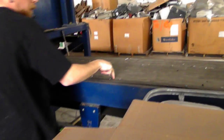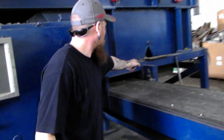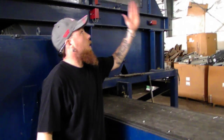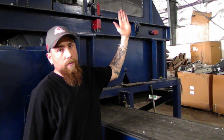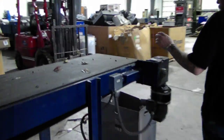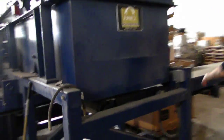These belts have to come off. The arms pivot so they fold in, and they're held up by these pins right here. Those two pins, because this was designed to be flipped up for storage, so we can get in and out of here. Just the hydraulics aren't hooked up. Same with this one. This belt is identical to this one, so it's the same thing. Take the two pins out. Bam, bam. Hold your legs in.